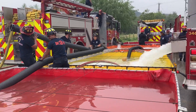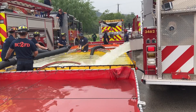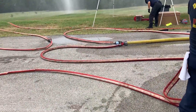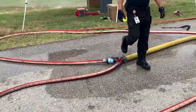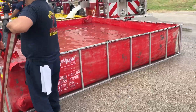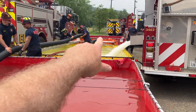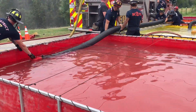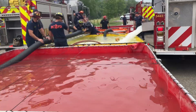It has not run out of water yet. We did purposely make a transition over to that TFT low level in order to make that happen. Running it off of a gated Y over here. We do have a TFT show flow in there on that front — hard to see. That jet siphon right there, coming from the red tank to the orange tank, that's 6-inch. Our show flow was reading 120 gallons a minute — so basically 120 gallons a minute to make that jet siphon look like that.